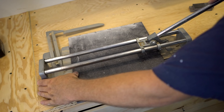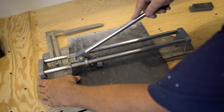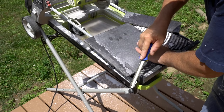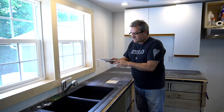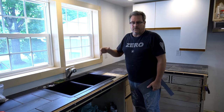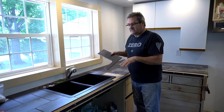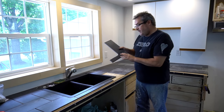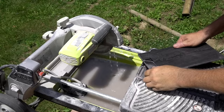I did a lot of the cutting on my tub saw outdoors with the diamond blade, especially for pieces that were narrow — I didn't want to take a chance on breaking them with my regular tile cutter. After the cuts were made I had to bevel the edge slightly with a diamond file so they weren't too sharp and would match the other side a little better. It took a long time to make all these cuts. I did start with a layout I did in SketchUp beforehand, and that really helped get me started, though I made a couple of changes as I went.